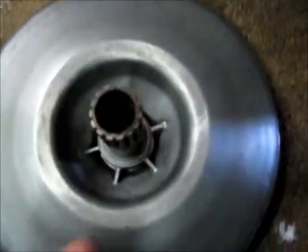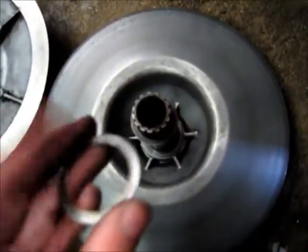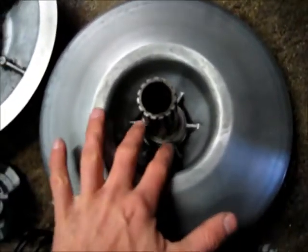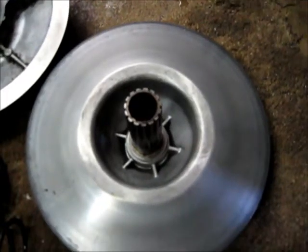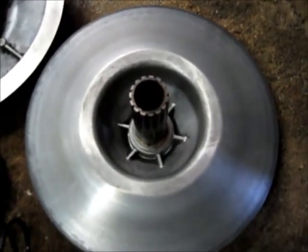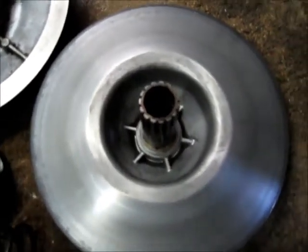You can grease inside there — that rides on this shaft here. With a brand new belt you should have two shims. What I usually do is have a new belt and a brand new spare belt, run the two shims, keep running those, swap both belts until they wear at the same rate. Basically when you need to take one of the shims out, you'll just keep both belts adjusted the same, so you don't have to worry about it if you ever get in a situation where you need one.